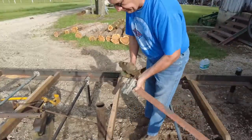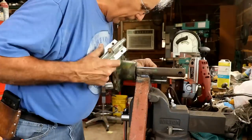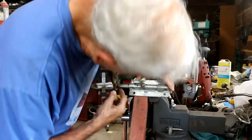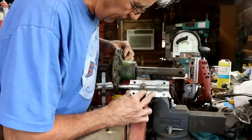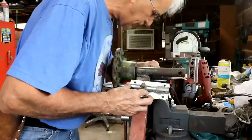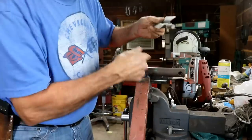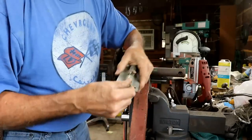I'm in the shop and I'm going to make another indexing pin for this other side. I think I got lucky here — this looks like it's going to work without any real modification. When this one is engaged on the other side, this one is exactly halfway between, and that's exactly what I need. So whenever I move this, I can go to this next hole and this one's unengaged — it just works perfectly. The problem is that this pin is way too big to fit these holes, so I'm going to take this apart and turn this pin down and then put it back together.